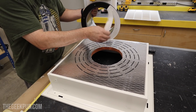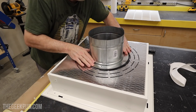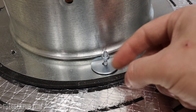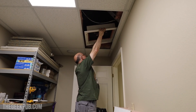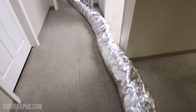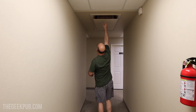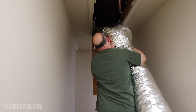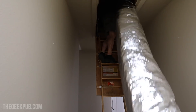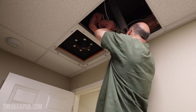The starting collar I chose has an adhesive-backed foam pad for air tightness — this type is generally used on sheet metal boxes where you attach it with self-tapping screws. In my case I just used number eight machine screws and some fender washers to make it work. Then I set the assembled box into the drop ceiling in the server room. At Home Depot I bought a really long section of insulated ducting. Since I didn't think about opening it in the attic, I had to pull the whole thing unraveled up the stairs into the attic. After a little fishing, the ducting arrived at the server room.